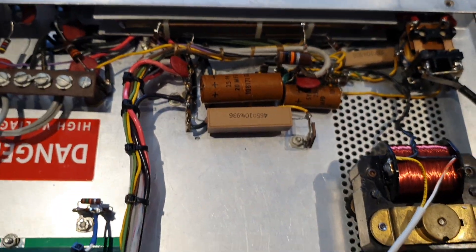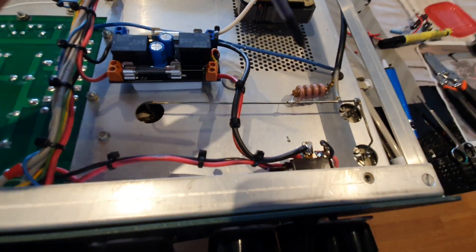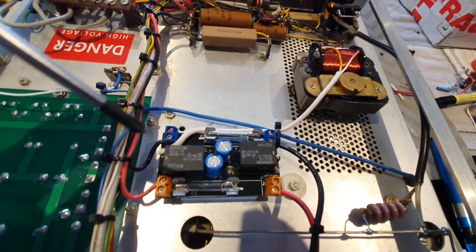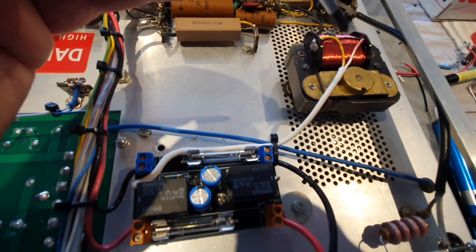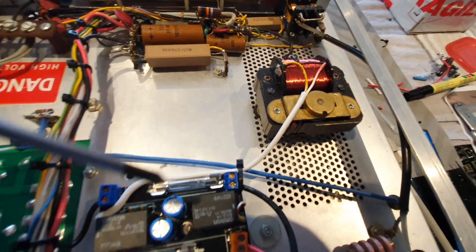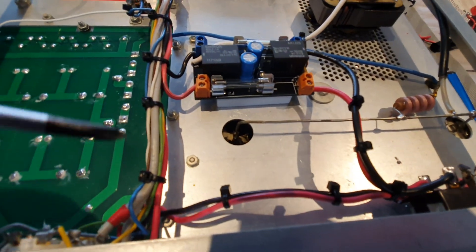So what have we done? We've taken the switched wires off the switch here, straight into the soft start module, screwed those in either side. And then this is the return line to the transformer. To get power to the relays, I've taken off one side of the fan, and it goes to here. And then this side of the fan goes to this side. And then I've just sleeved some fiberglass cover on the top of that, and cable tied all of the cables to keep them out of the way.